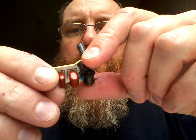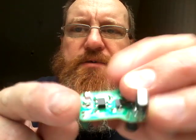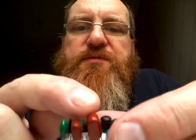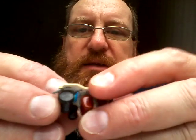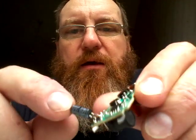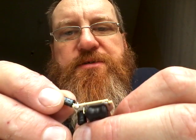And there's a component that could be a fuse — yes, F1, it's a fuse. So: fuse, suppression, metal oxide varistor, a bridge rectifier which that's going straight to, and then a couple of stages of filtration with these capacitors and this small choke here. Then it's being switched with this chip through this choke, and the output will probably be rectified by a diode, then a capacitor, and the LEDs will probably be directly across that — if it's anything like the usual.